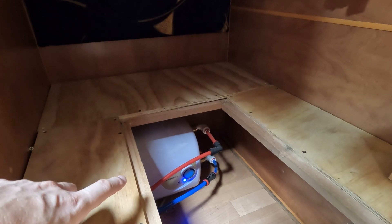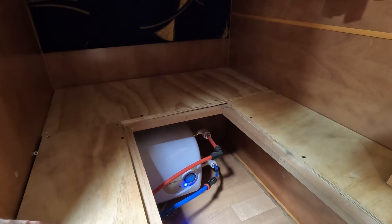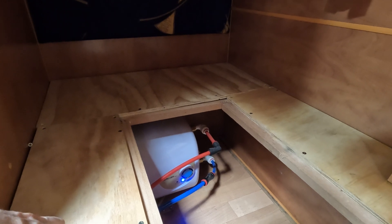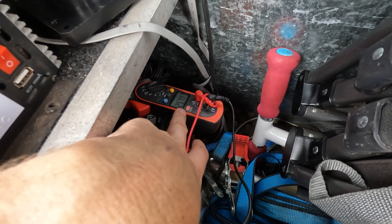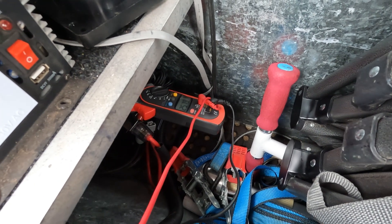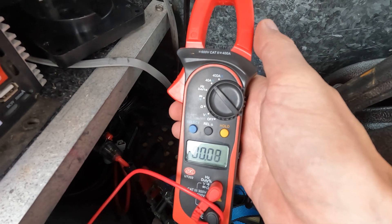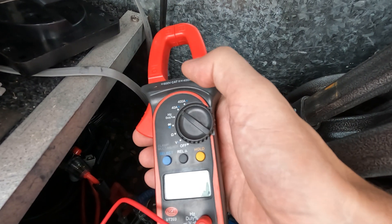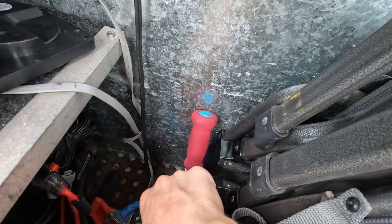If you don't want to use 240 volts to heat the water when running off an inverter, you definitely want a 240 volt switch you can turn off so it heats with 12 volts instead. I think you need around a 1500 watt inverter — the heater is 1000 watt rated. I've used it by accident on our inverter a few times and it heats the water up really quickly, but it also uses a lot of power. I've just clamped my amp meter on and it's drawing 25.8 amps on the wire going to the hot water heater. I'd highly recommend grabbing a clamp meter — they're super cheap at Repco or similar.